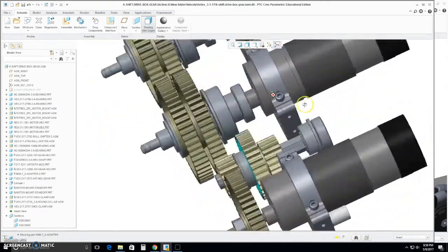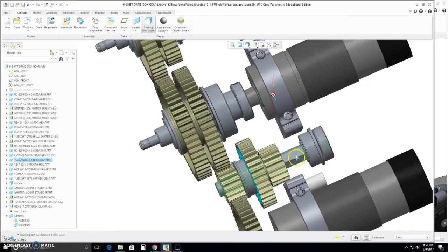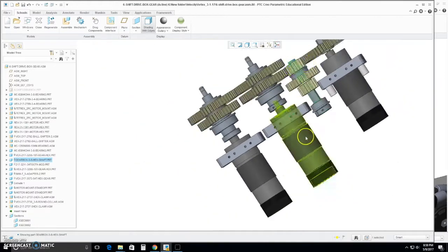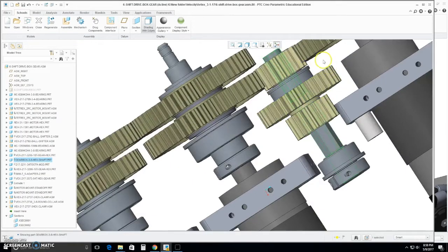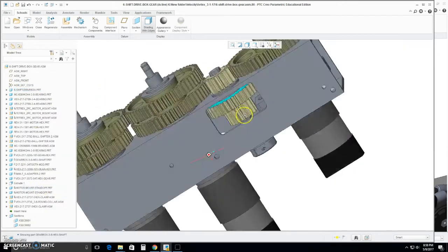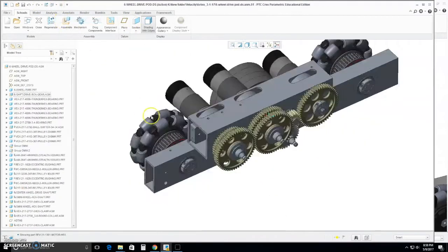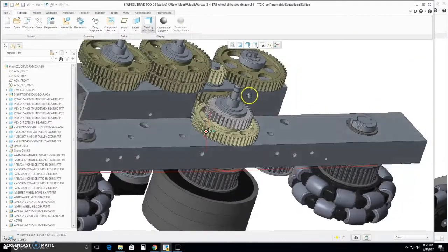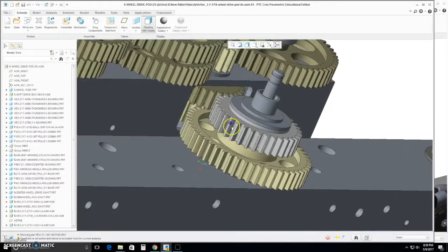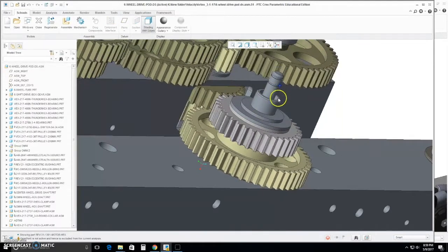With these gears, you can see with the main drive gears, they immediately go into this shaft that's hidden inside the gearbox. So these gears are actually connected within, and this allows for a very compact design. Once these gears come out the bottom, they're able to connect down to the 2-speed shifter, which you can see here, where the gears connect right there. So this allows us to have our 2 speeds and then have the shifting rod be right here.